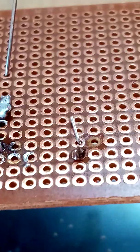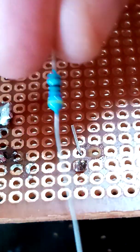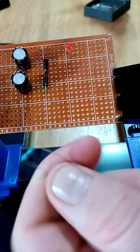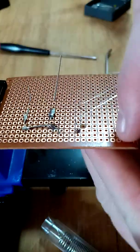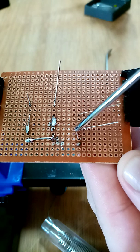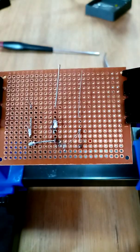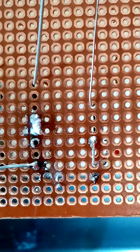Once you put the LED in, you need your little resistor. The resistor is going to go from this point down. It doesn't matter which way it goes. The resistor from the other end — this rod — goes to the LED point here, so hook that to here. Turn it upside down, and then snip it off.